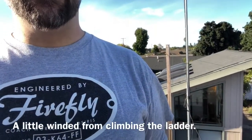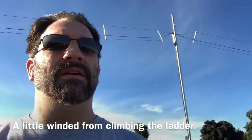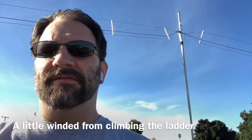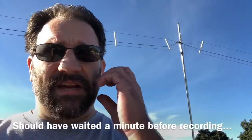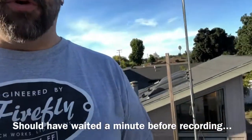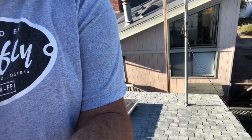That's what I wanted to show you today — how I built mine. So let's go up on the roof and take a look. Here I am on the roof, and that is my antenna mast, which is literally just a section of one-and-a-half inch — maybe one-and-a-quarter, I don't remember exactly — steel irrigation pipe that's been zinc coated so it doesn't rust. It is literally just poked through a hole in the roof right next to the overhang.